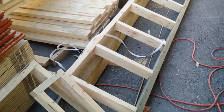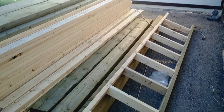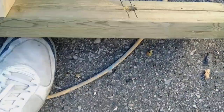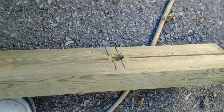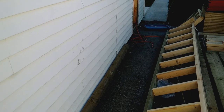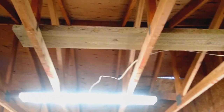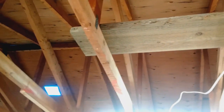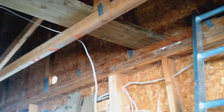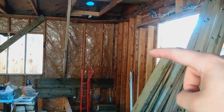A little math told me those were the best spots, and they also had to line up from side to side. There's additional corner reinforcing and beams on the outside of the door. I also fabricated the pony walls that go underneath the wall — in my case lifting 21 inches takes me to a nine-foot-ten-inch ceiling. I constructed these pony walls at 21 inches high, pre-marked and drilled out where the footer bolts go. The plan is to gradually lift it up, slide the pony walls underneath from the outside over the bolt stubs, bolt them down using the same nuts, and set the garage back down on top.